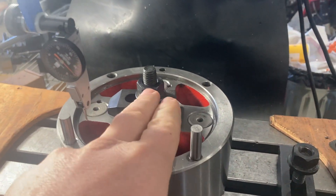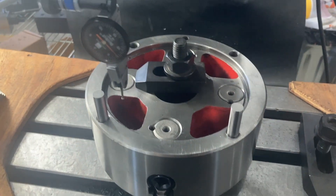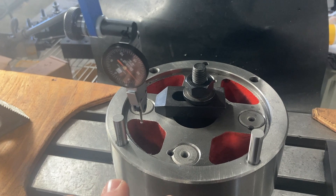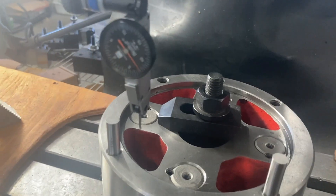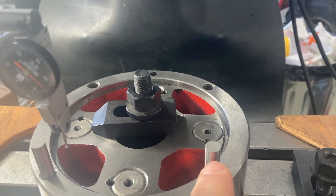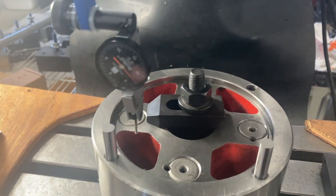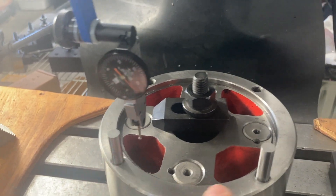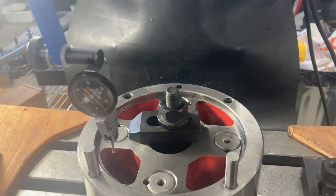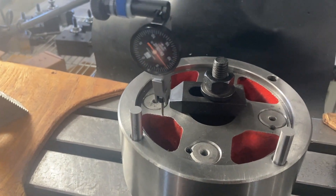I have the part just finger-tight right now, holding it enough so that once aligned I can snug it up by hand. We're not doing any machine work here, so we don't need it strapped down super tight — we just don't want it moving while taking measurements. I'll run my indicator to zero on one pin, then go over until it zeroes on the other, moving the part back and forth. Because I only have one set of gauge pins, one pin is one thousandth smaller than the other, so I'll end up with plus half a thousandth on that side when fully aligned.